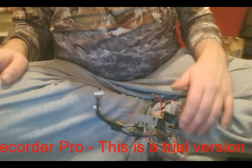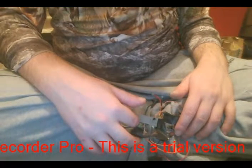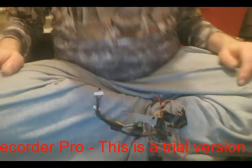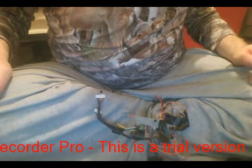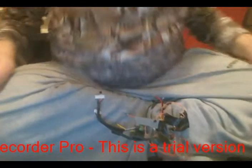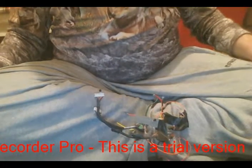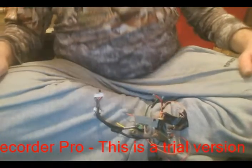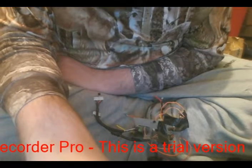And I believe that if any of these LEDs are just solid on instead of flashing, I think that means you have a short on your transistor, and that makes it where it'll not oscillate. Because it could be a short on your emitter collector, short on emitter base, whatever two pins it has a short on. Anyway, let's take a look at the schematic.